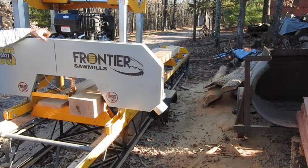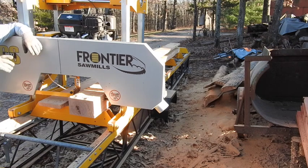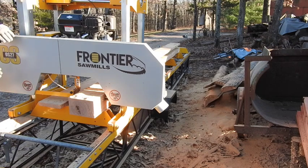I don't know what to say, guys. It's either operator error or the improper blade for the material. The blade didn't look too awful damaged, but I'm noticing how dull the teeth are. The tips of every one of the teeth are shiny, and it did not go a revolution grinding against metal. This wood is dulling those blades. I believe I got the improper blade for the application.